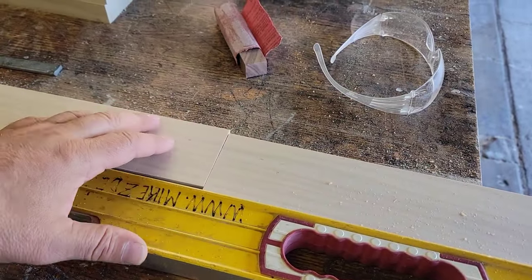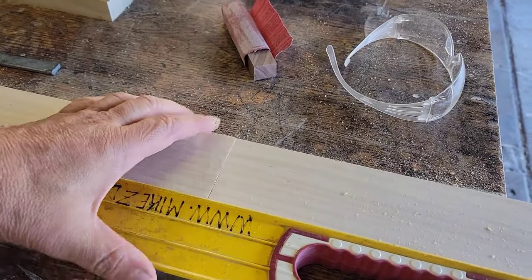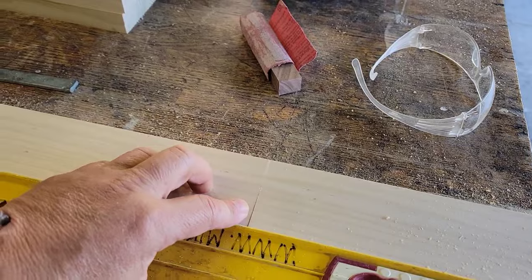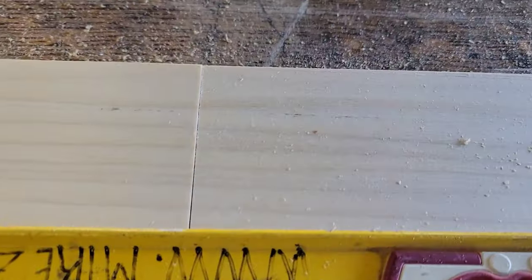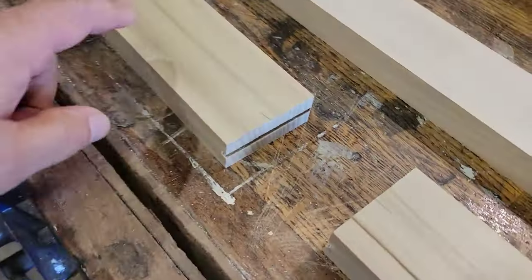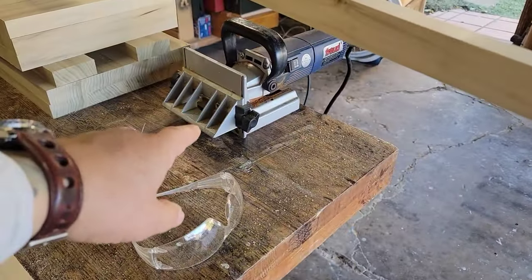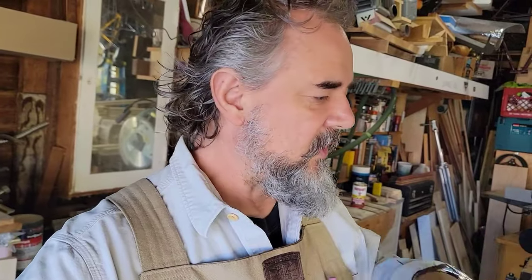I might try a 45 or a tongue and groove because you want surface area for glue. But what I'm going to do — look how the grain winds up — it's actually going to be a pretty tight joint. I took a couple pieces of scrap and used my biscuit joiner, which I haven't used in forever. I used to use it all the time when gluing up boards to make tabletops, but after a while I started experimenting with no biscuits at all, just Titebond Two, and haven't had any problems since.